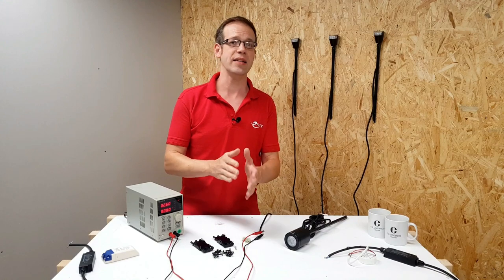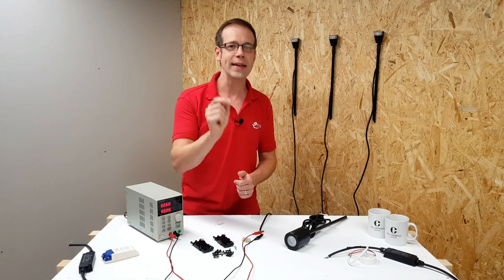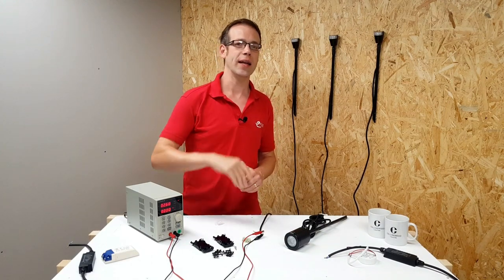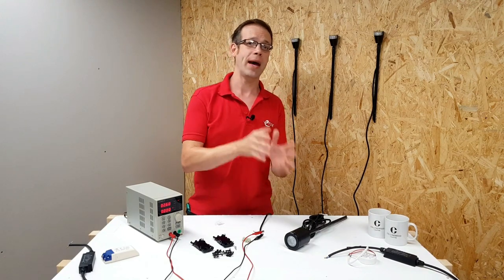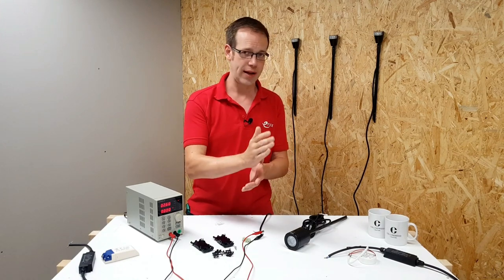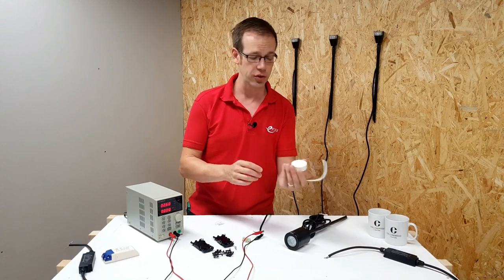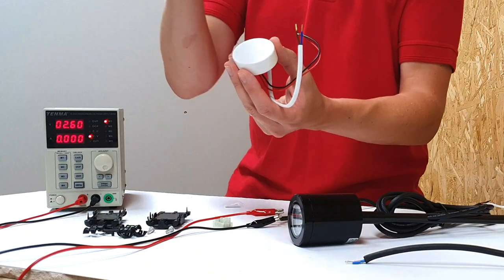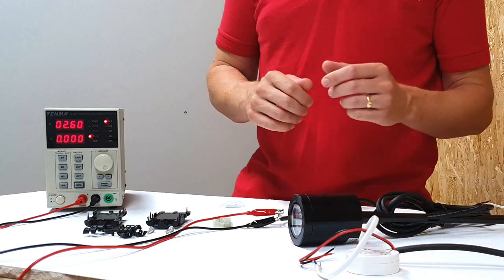If you're putting together a system of LED lights, think about the current you're connecting them to, how much power each fitting will dissipate, and what the total power will be that you're connecting to the driver — that total cannot exceed the maximum power the driver can deliver. Most drivers also have a lower value of power they will operate on, so if you connect a 0.5W fitting to a 1–5W driver, it won't work properly. That's why we occasionally run into problems when dimming LEDs, because the power goes too low.